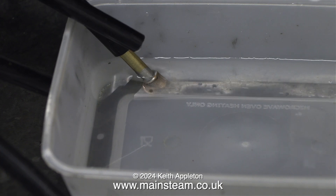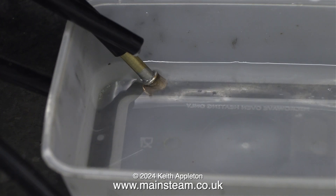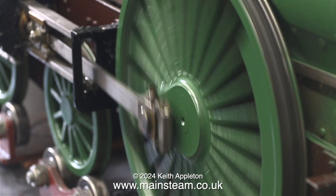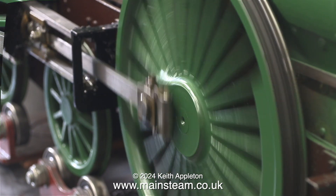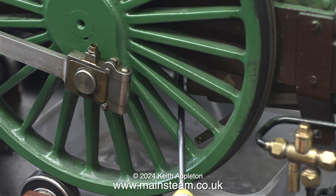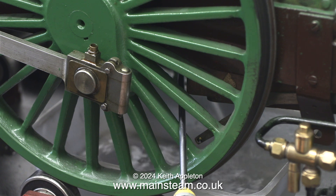This is quite a slow process because it only gives one squirt per revolution, so the video is running at a higher speed, and now so is the engine. All of the water soon went into the boiler. I turned off the air supply and unscrewed the blow-down valve, and the water has been returned into the tub which conveniently fits underneath the locomotive.